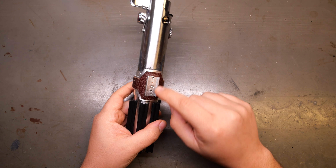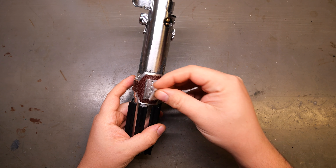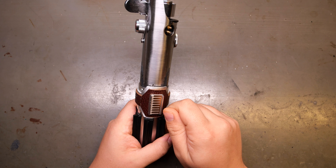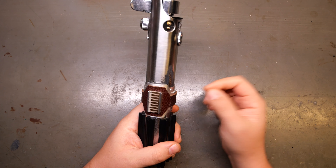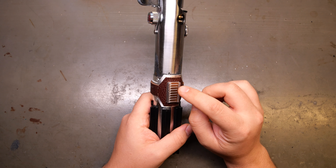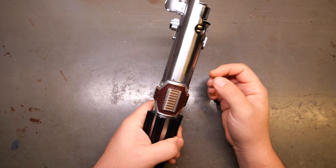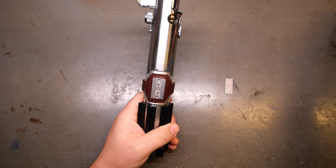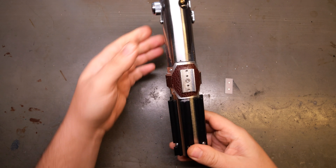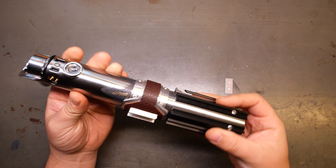That is necessary because this screw up here and the screw down here basically secure the top and bottom parts of the Graflex into this section. They attached grub screws with plastic tips so as not to mar the metal, and it grabs these parts really well. It's tight right now, and honestly you really only need to loosen the bottom grub screw. Once you loosen it, it gets very loose immediately and allows you to just easily remove the bottom.